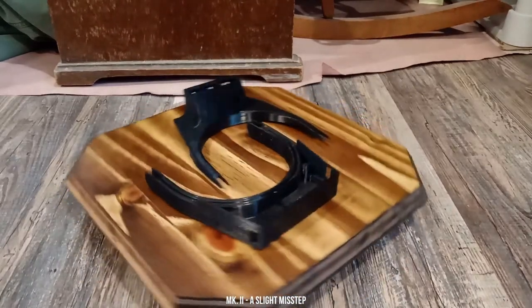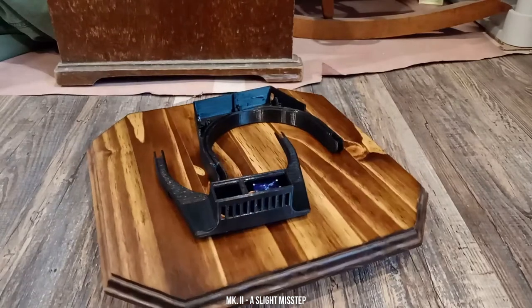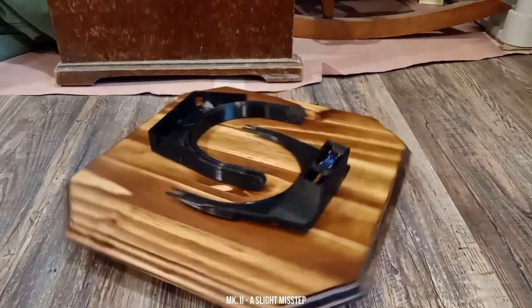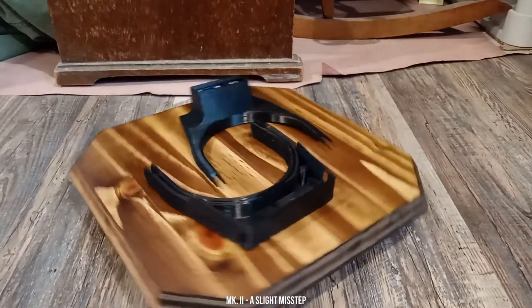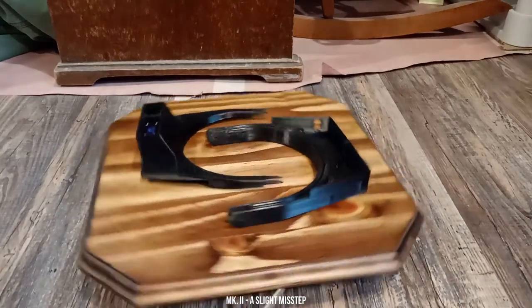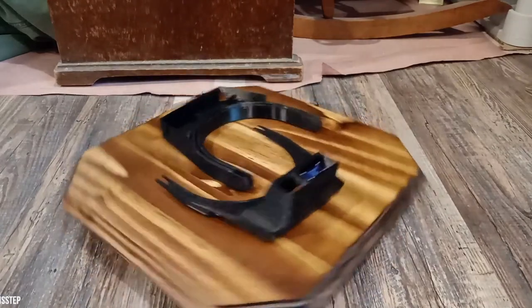My tolerances were way too tight, so the internal parts didn't quite fit. I also created a bit of a catch-22 when it came to installing the servo motor. The string guides were all on the bottom, but the servo attached to the top. In order to attach the two, the case had to be closed, but if I wanted it to work after I closed the case, the servo motor had to be attached beforehand.